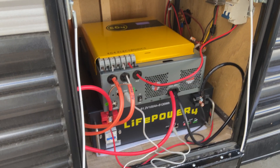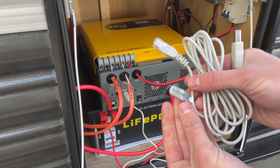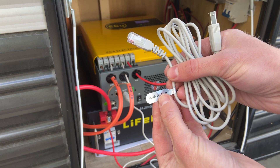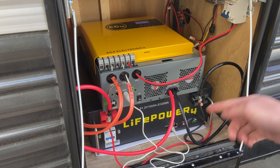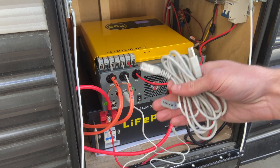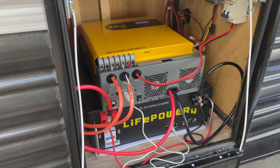Now for some complaints. The inverter comes with two different cables — one of them is labeled RJ45 pin 7 and 8, the other one is 1 and 2. I wasted a bunch of time trying to get it to work with the wrong one. I figured they just gave you an extra cable, but they are actually different. So use the one that says pin 1-2.